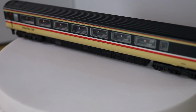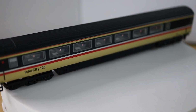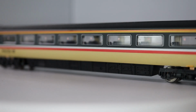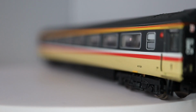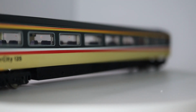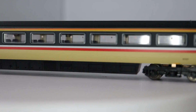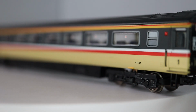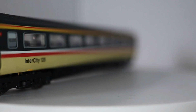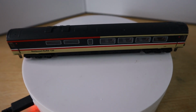Most of the surviving fleet of Mark IIIs and derivatives were still in revenue service on the British railway network in 2020. However, as of 7th of April 2021, 300 carriages have been sent for scrap. The Mark III looks similar to the Mark IID, 2E and 2F coaches, but is of a completely different design. It has a ridged roof and underframe skirt, compared to a smooth roof and visible below-frame equipment on the Mark II. The body shell is 75 feet long, almost 10 feet longer than the Mark II, of full monocoque construction with an all-welded mild steel stressed skin, and it has a reputation for its exceptional strength and crashworthiness.